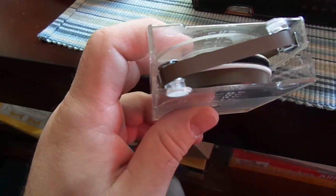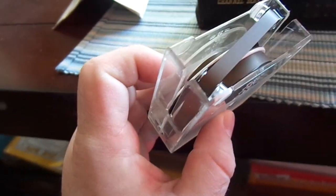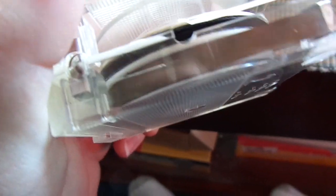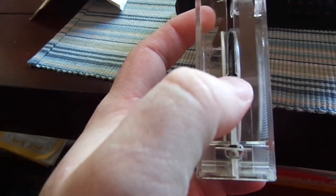There are two open reels mounted side by side and they link over — so it's a continuous tape that links diagonally in the middle. The motor is a rim drive mechanism. If you look on the inside between the two reels, each reel has a rubber pad that encircles it. When the tape is slid in, the motor shaft slides along this groove and lines up right where this hole is. When you engage play or rewind, the motor shaft rubs against the rim of the pulley and drives the appropriate side. Because of this elongated hole, it gives the motor the ability to go back and forth and locks the tape in place. Pretty ingenious.